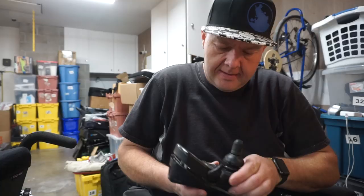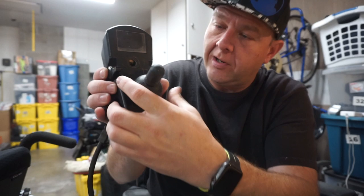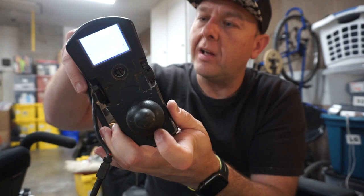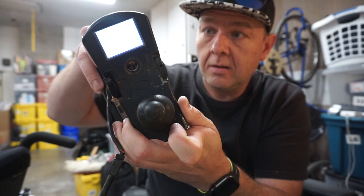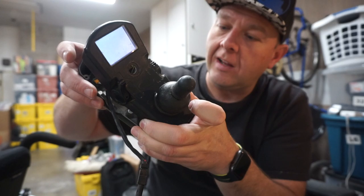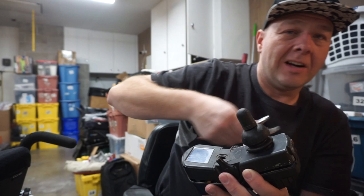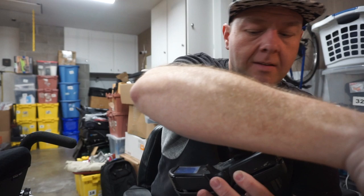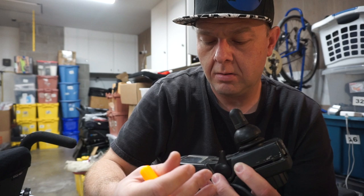Let's give it another power up. Full white screen. Let's see if I can gently poke at the LCD cable and see if anything changes. It doesn't seem to have any effect. Let's give it the ol' shakedown test — doesn't seem to have any effect on anything either. As it powers up, you can see the backlight flickering. I'm going to go ahead and call this thing a dead LCD.